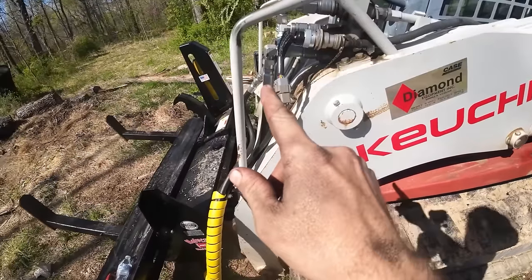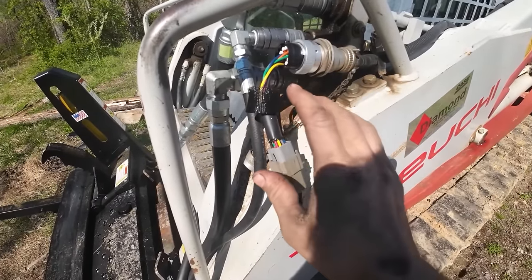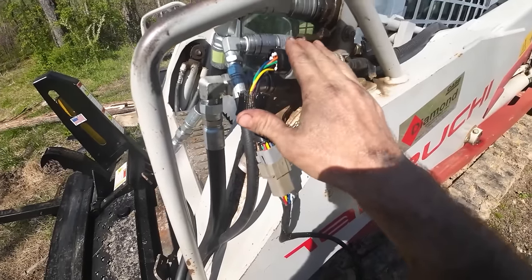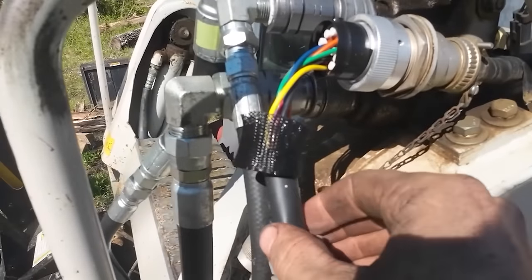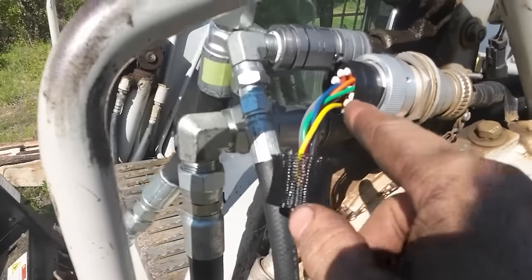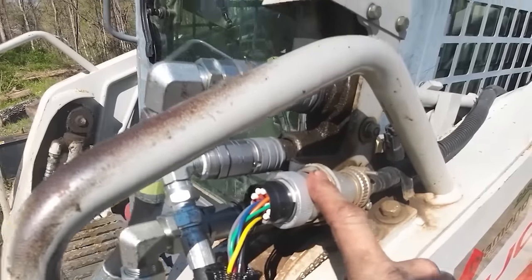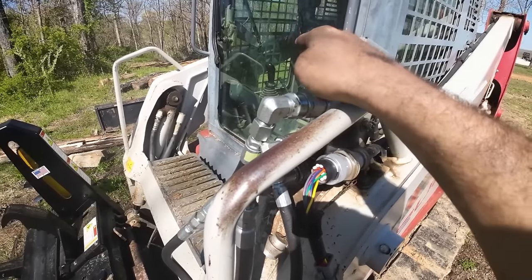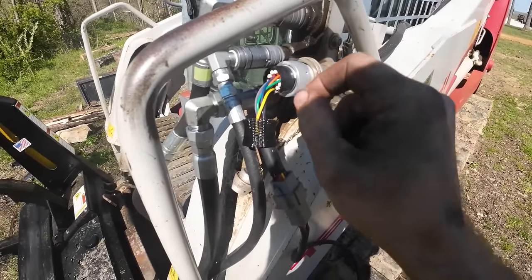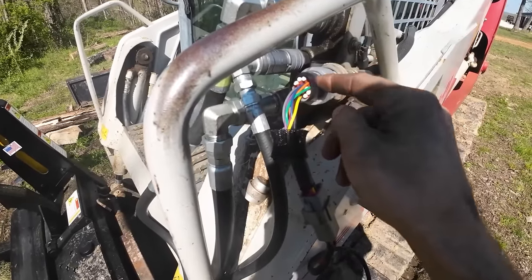One thing I feel like I didn't explain very well when I said they got this thing hooked up, this was what I was primarily talking about. This is completely customizable to any machine. They send this part of the connection and this part of the connection and they're separate. And what you do is you go through on the pins. Clint basically took a multimeter while Jay hit buttons on there, the buttons that I wanted to use on the joystick, and he'd held that. Clint would go around and find that pin, they'd label it, and once we figured out what controls we wanted on that joystick, they just plug and played the wires in.